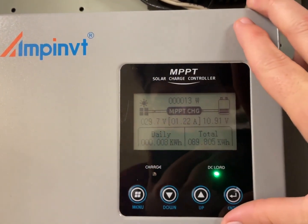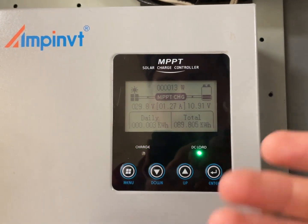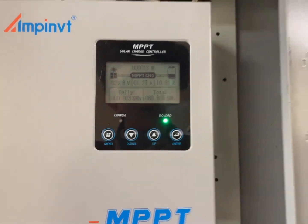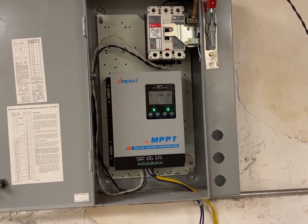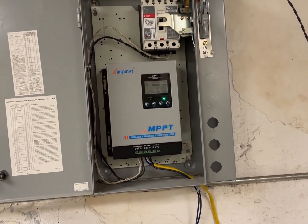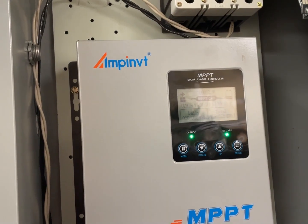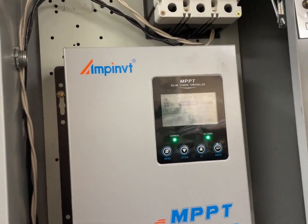We actually have a bit more power. When I first plugged this in — this is just charging one of the 200 amp hour batteries — it was only giving 8 watts, then 10 watts, and now 13 watts. So we can slowly see the clouds move away. I wouldn't be surprised if something similar is used by weather reporting to detect the brightness of the sun and detect how thick the clouds are. Because I connected this battery whenever it was fully discharged, the BMS of the 200 amp hour battery had disconnected, so I had to jump start it with this one. That's one unfortunate thing.